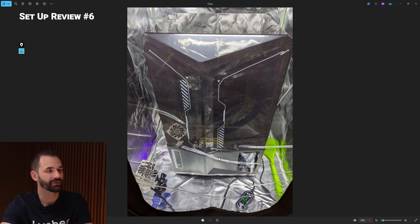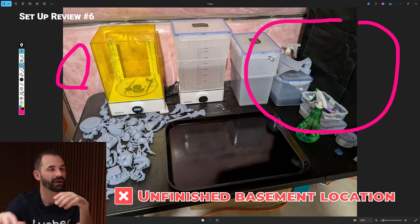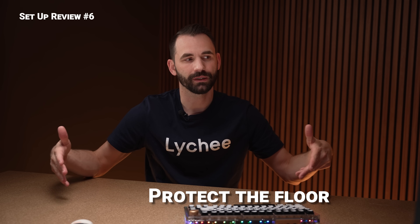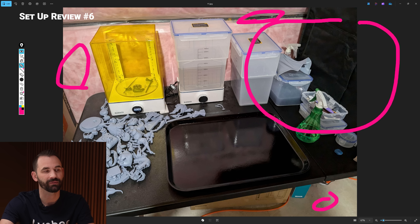This might be the same user — yes, it's the same user. So this is inside the grow tent and this is outside it. They've got some plastic covering up in an unfinished basement. Concrete floors are still absorbent — if you drop resin it's going to absorb into the concrete. Not a big deal, but maybe put down some plastic or a nicer, heavier sheet for the work area. I might also hang some MDF board with plastic over it, just to make sure the fumes can't get into the house or into the insulation so it doesn't stink later if you ever finish the basement. Those are nitpicky suggestions — you don't have to do that — but it would prevent problems in the future, and all of it would probably cost under a hundred bucks total.